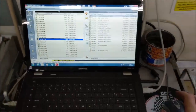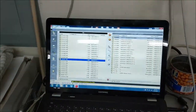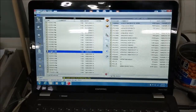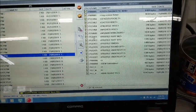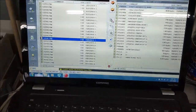I transferred that file over. This is the shop computer hooked up to the mill via that USB cord, and this is my WinDNC software that talks to the control in the mill. This is the file we just created — I had to renumber it because the control only likes these numbers. Now I've got it highlighted and this little lightning bolt icon will send that to the mill, and it is sent.